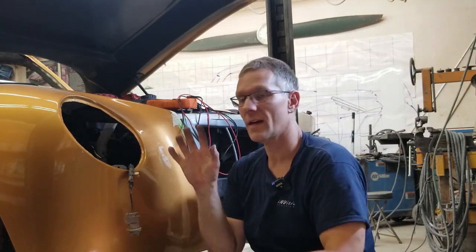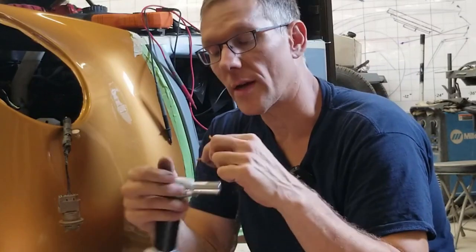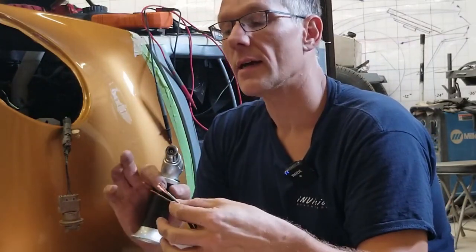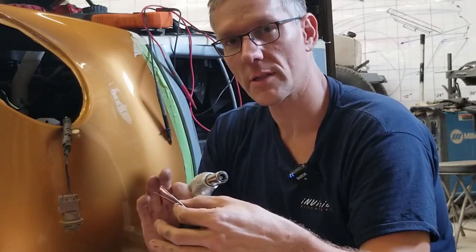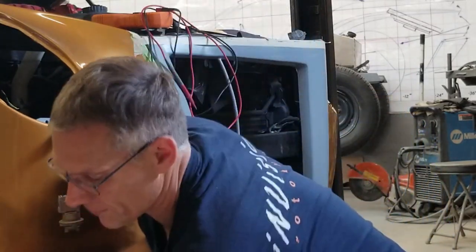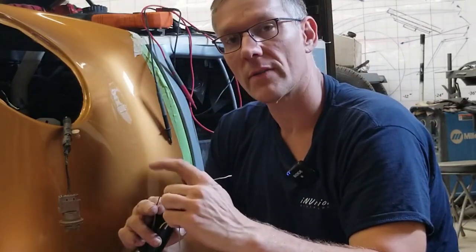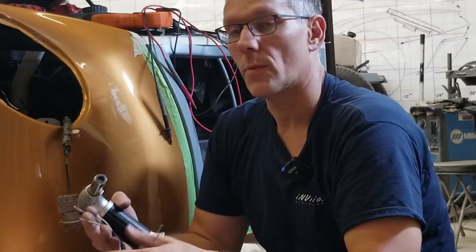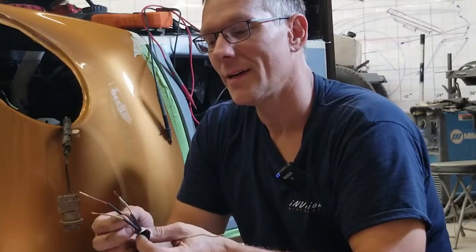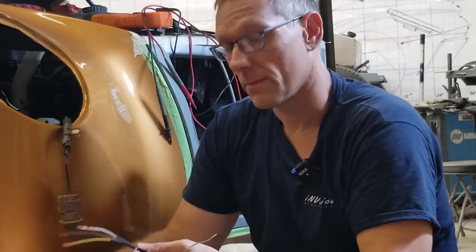Now it's going to get kind of tight in here, so I'm going to basically show you out here. Going to wrap the one wire around the other and make sure we have no loose strands sticking up. Use a little torch, heat the wire up — you don't want to overheat it, and you don't want a cold solder joint either. So heat it up just enough. Through experience you'll figure it out — practice on some scraps — and then use solder for electrical, not the plumbing stuff. Feed it in to the wire until you have a nice, shiny, coated, braided joint. Once it cools off — not any sooner, because you'll find out quickly why — take and slide the insulation up over top. Use a torch, play a little heat over it, and it's done.